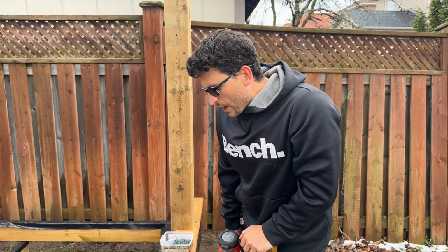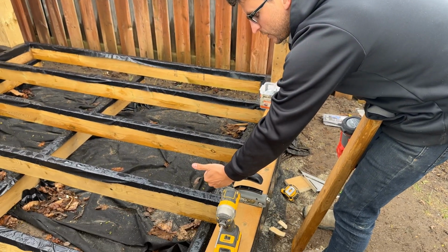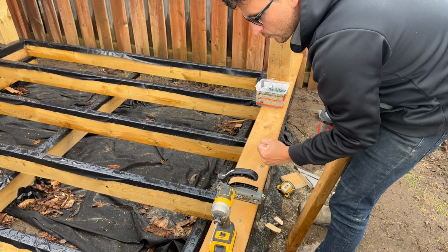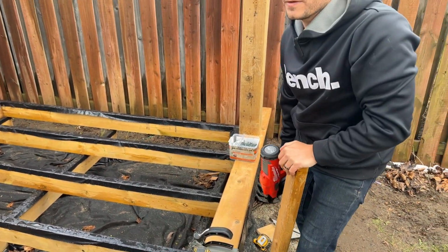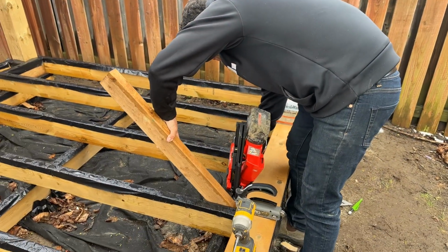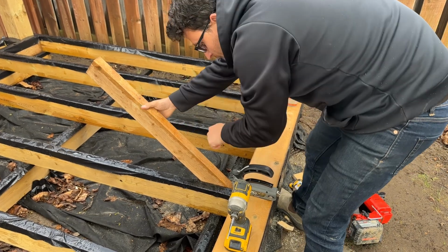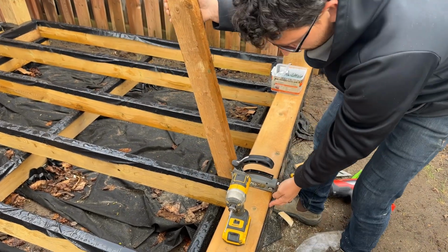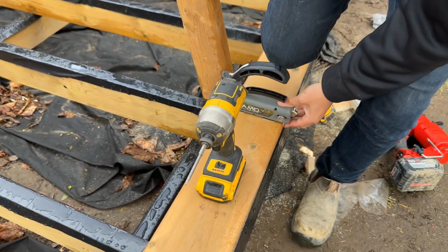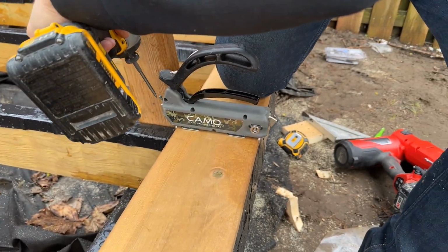It's a weekend. So the old school way, I would hammer a chisel or a pry bar into the joist and then wrench it over, but with all this joist tape, that'd be counterintuitive and kind of stupid. So we're just going to make an old school fulcrum lever. Pop this in here, one nail. Make sure our screw's ready to go. Grab it here. You can watch this gap close before your eyes. That's it. And we send it home.